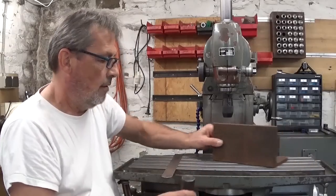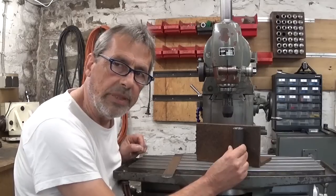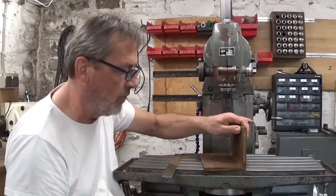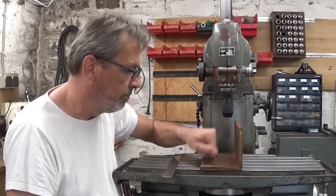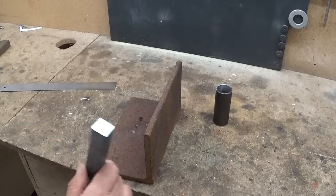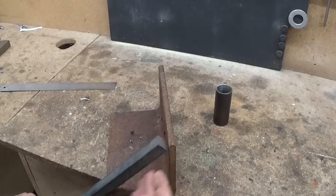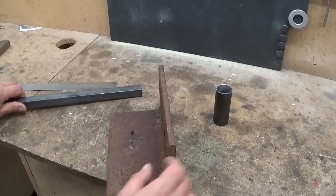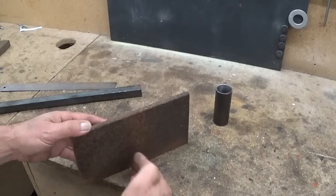Of course, keeping this all length just to hold a little part like this one, it's a bit pointless. And also I'm gonna try to find some pieces of something to reinforce, welding 2 pieces in here. I think I found something. This is 20 millimeters square, cut at 45 degrees. That could work. Right, let's take the wire brush machine and make some brown dust and cut the piece in 2.